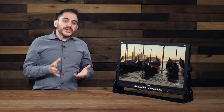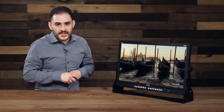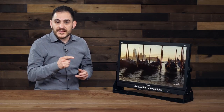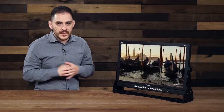So we have all these inputs on the monitor — what can you do with them? You can feed it one 4K image via HDMI, three standard high-definition images via the other HDMI inputs, or 3G SDI through the SDI. So you can get one 4K image, or up to four standard high-definition images as well.